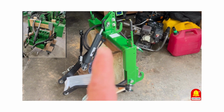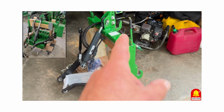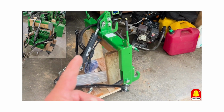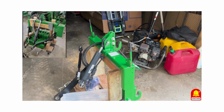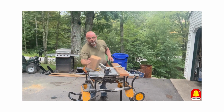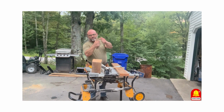So now I'm going to go ahead and build. He had put a couple of uprights on each side so that it can slide right down into it and it guides it in. He put 45s on the end. I thought it was a great idea. I forgot about those, so I'm going to go ahead and cut those now and add them. Okay, so I've made 3 of these so far, and if you look, there's a 45 on this, and that's going to aim towards the hitch, and they're going to be on either side, so it guides the hitch down into the slot.